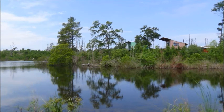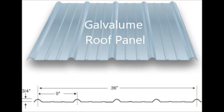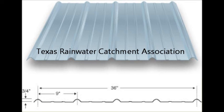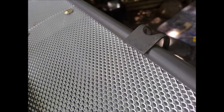You're looking at a homestead that has had an off-grid rainwater catchment system since 2007. Starting at the top and working our way down, our house has a Galvalume roof. Galvalume is recommended by the Texas Rainwater Catchment Association. It is important not to use tar shingles on a roof to catch rainwater because they leach toxic substances into the water.